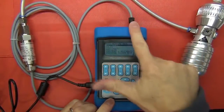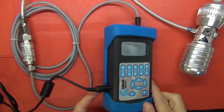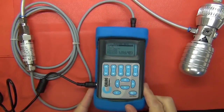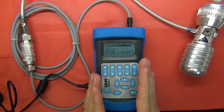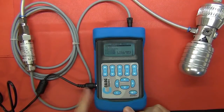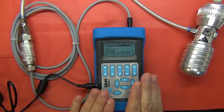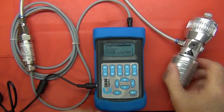I've got the pressure sensor connected in the top port. The handy thing is it also has a DC input which you can use for charging or powering the unit. So if you were using this in a situation where it's simulating or replacing a faulty transmitter, you'd plug in the power so it can function operationally without the battery going flat. This is a little pump we'll be using.